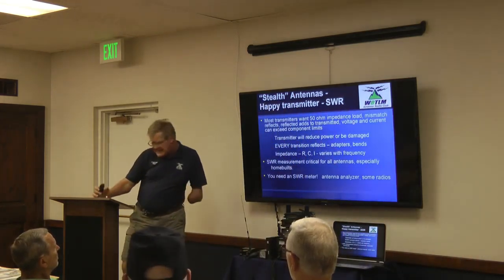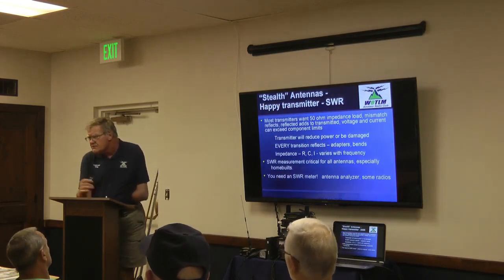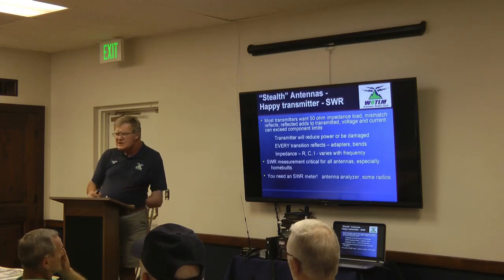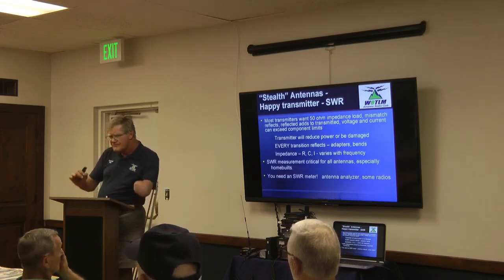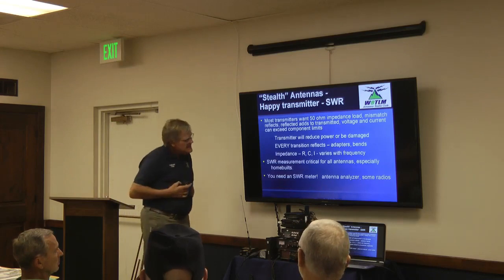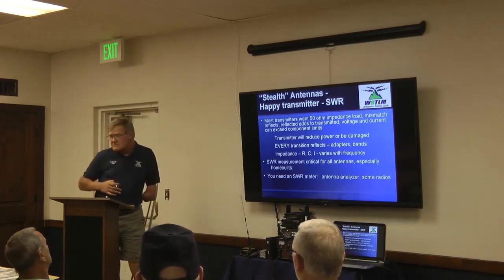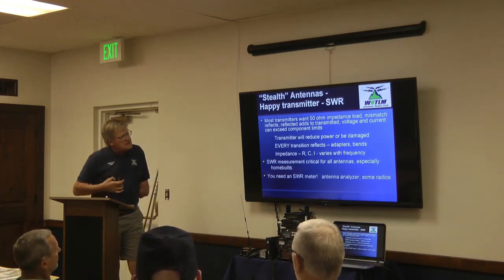And again, if you're going to build antennas, VHF or HF: when I say VHF for this discussion, I mean anything above 50 or 100 megahertz. When I say HF, for this discussion, I mean anything below 50 or 100 megahertz, okay? And again, some radios have pretty sophisticated SWR and antenna analysis capability.